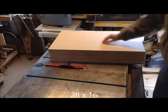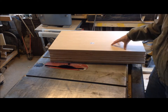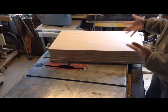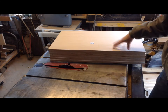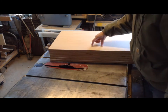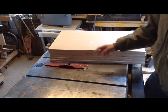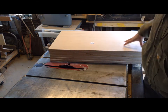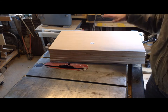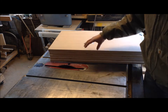I have my stack of six pieces — they're all exactly the same size. I actually cut seven of these, but one is going to be the middle of that cabinet so it won't be as tall as the others; I'll just trim that one. Now I'm going to go through and each one of these is going to have a rabbet on the top, a rabbet on the bottom, and then a dado right in the middle for that middle shelf. I'm going to switch out my cross-cutting blade with my dado blade and set it up to cut all those rabbets, then set it up to cut an identical dado in the middle of all of these. Then my sides will be done and I can start cutting the pieces for the bottoms, the tops, and the centers.